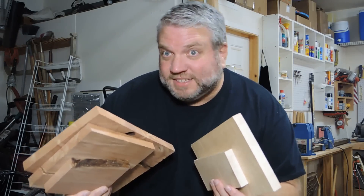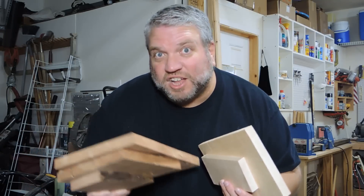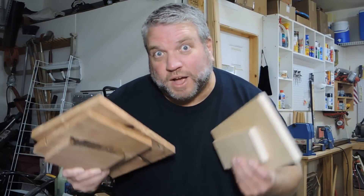I'm going to use these small pieces of red cedar and curly maple to glue up my own 2x2 turning blank that has diagonal contrasting stripes. So the first thing I need to do is to rip these down into 2 and a quarter inch wide strips.